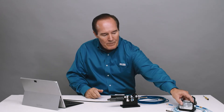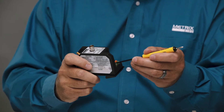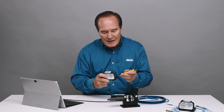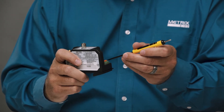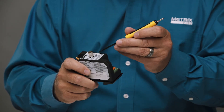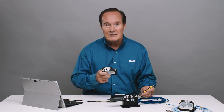This is our driver. I'm going to be using the transmitter. This particular transmitter has four pins. The first two pins are for loop power, and that would go to a control system, providing the 4-to-20 signal to your normal control system, a PLC, or a SCADA system. Then we have another two pins that go directly to the signal-in-common pins of a monitoring system. So you could see both the 4-to-20 to a control system and the signal going to a monitoring system at the same time. You can also connect test equipment to the BNC without causing a problem with the 4-to-20. It makes our system pretty unique, and that's why I'm going to demonstrate it today. Let's go ahead and get started.